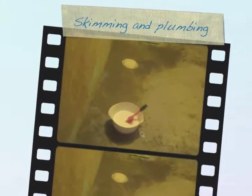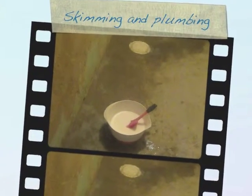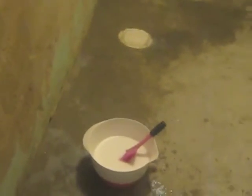Right, I've just been putting the layer of primer on, which is a light solution, a very diluted kind of wood glue, it smells. Anyway, I've put that over these walls, which have now all been taken back to the basic rough plaster underneath, and now we're going to do what's called speckling in Swedish, or skimming, we call it in England.